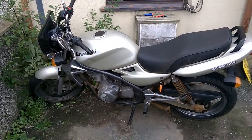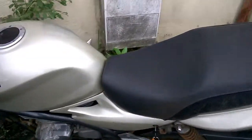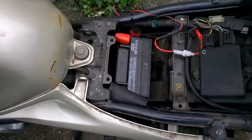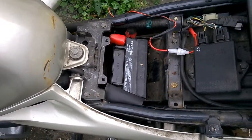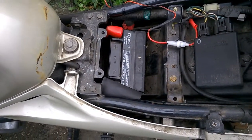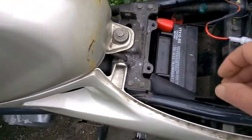Here's a good one — I've got a battery drain problem on a Kawasaki ER5. Just get the seat out of the way. It's just a 12-volt battery. This started off a couple of months ago; it was draining about 100 milliamps, so the battery was dead after about a couple of weeks standing. Now I've come to try it and it's drawing a fair bit more.